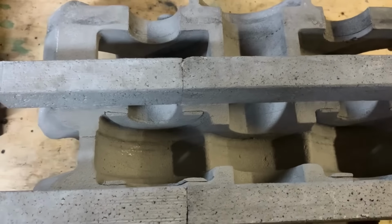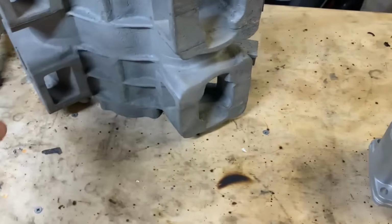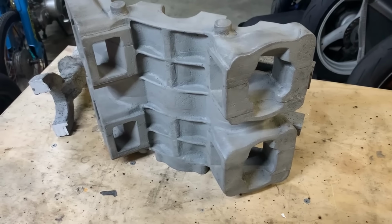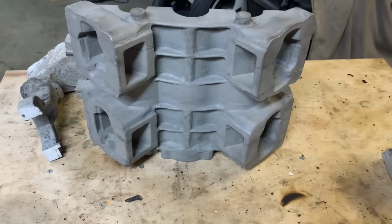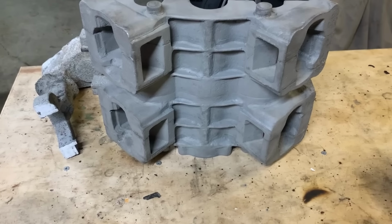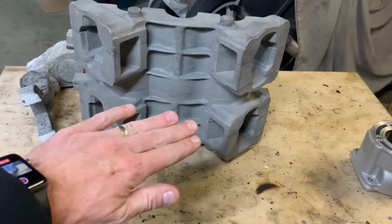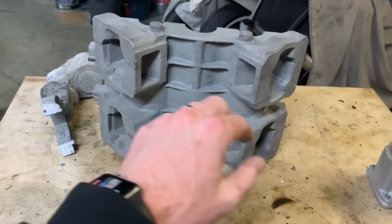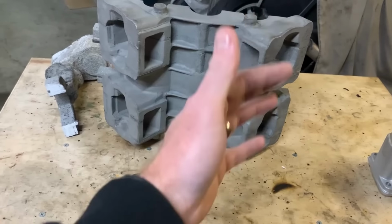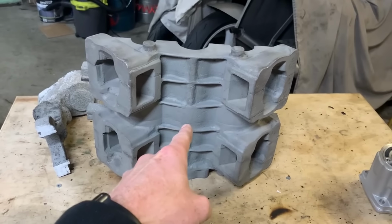Doing it again, obviously I'd do this all in one piece. A friend of mine is doing a CNC router fix up for it. Oh, CNC router needs fixing and I'm doing it. So I'm going to have the CNC router here testing it once it's fixed. I'm just rewiring really. But it means I can do this whole thing in 2 setups. Flip, do all 6. Only have to do each tool change once. Flip, do all 6 of the other side. And then I've got a pattern that's like 1 night versus this here, which is 1 week.